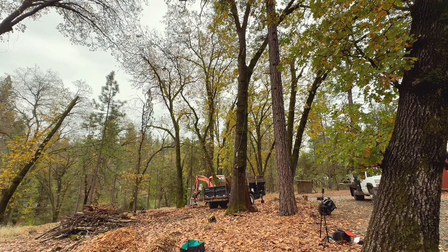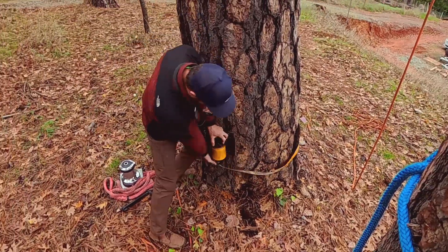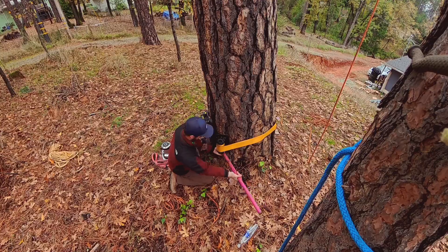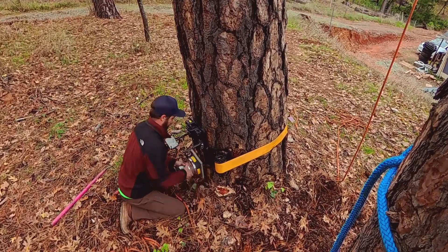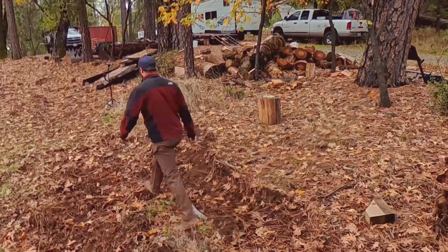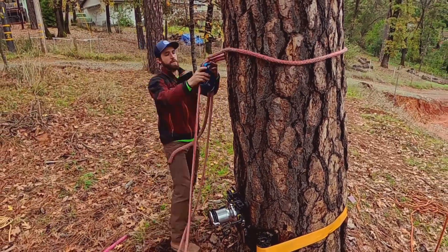Jumping right in, we're going to start off with the GRCS. The GRCS is the simplest to set up — not terribly difficult. I can do it by myself, though it's kind of a pain. My whole operation from setup to having the rope loaded took just about eight minutes, a little bit under — and that's pretty quick. It's also one device, so it's pretty easy to train. You do need a couple of things if you're doing a straight pull. Obviously this is the most expensive setup; the GRCS itself is a little over four grand depending on how and where you get it. You need a backup pulley above the GRCS so that you're pulling straight down into it. If you pull directly to the GRCS, it'll twist around the rope and blow up the whole device — ask me how I know, I did that the first time. There's a video about it.